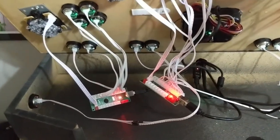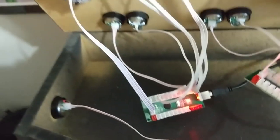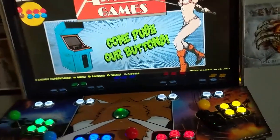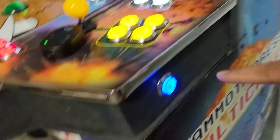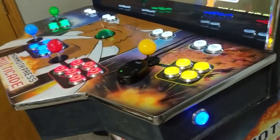These are interesting cables here — I actually had to splice these. Technically, all the buttons go into a USB board, and each of these boards plugs in via USB cable into the Raspberry Pi stationed in the back, which basically acts as a USB controller. It's pretty simple how it's set up. I also threw in a button on either side of the control board for pinball flippers, and they work amazingly.